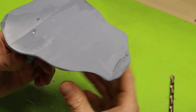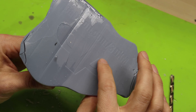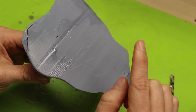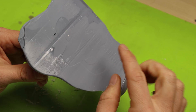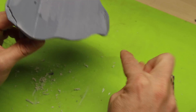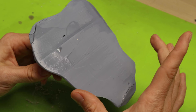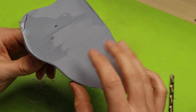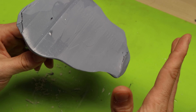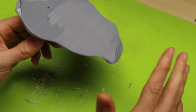One important note: if your resin print has no holes and you need to drill them in, remember the inside has uncured resin — and there is a lot more in there than you'd expect, because it clings to walls and collects in pockets. Do this in a safe spot where you can clean up any raw resin that drips out, then rewash the inside with alcohol. Clean your drill bit afterward and wipe down your work area of any resin residue.